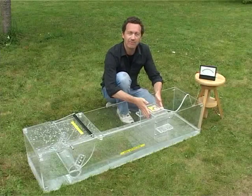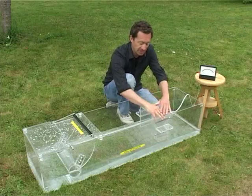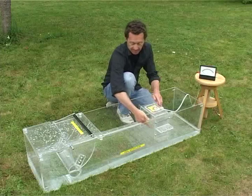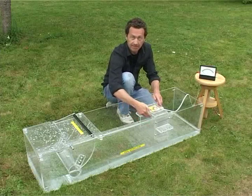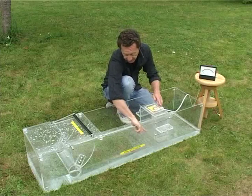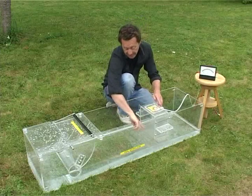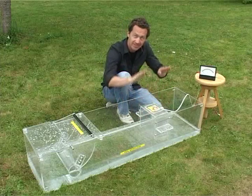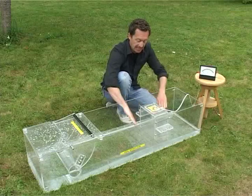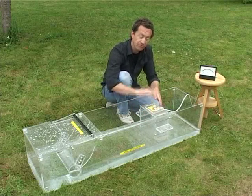This is the third type of way of making electricity from waves — it's called the limpet gen. What we've got is a chamber that's open at the bottom, sitting in the water, with air trapped inside. As we make waves, they come along and change the height of the water level inside the chamber in accordance with the waves, producing an oscillating water column. This is called the oscillating water column technique. As the water goes up and down due to the wave passing, it compresses the air inside and drives the generator.